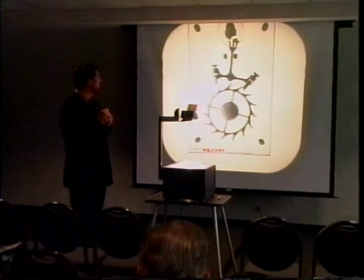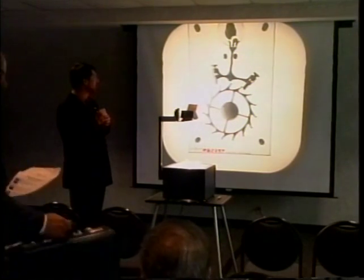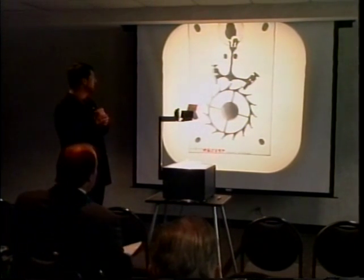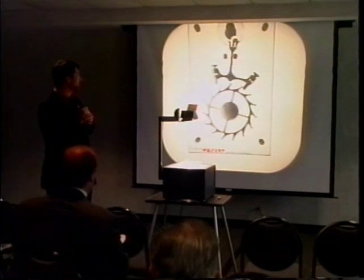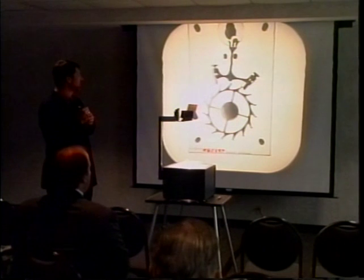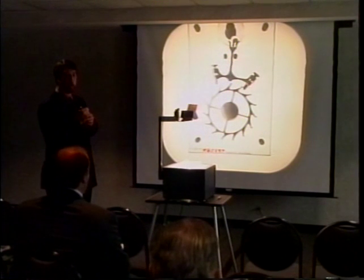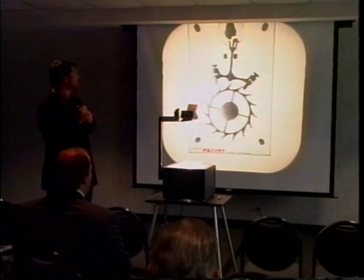Then on the pallet stones, we have locking surface, impulse surface, locking corner, let-off corner, pallet arbor, pallet stones, more specifically, entrance or receiving, exit or let off. Up here we're looking at the pallet fork shank to the fork slot, guard pin. What are the things on the side here? Fork horns,